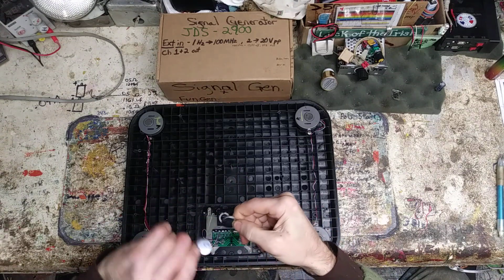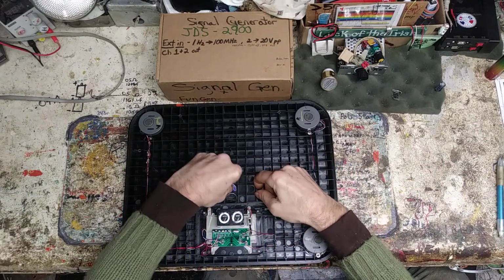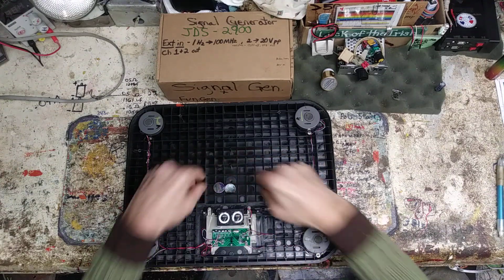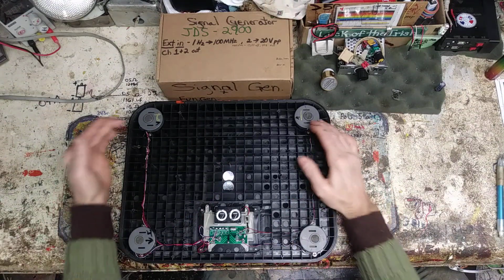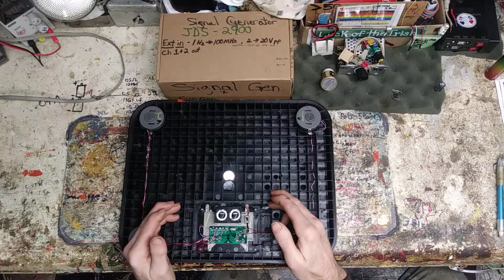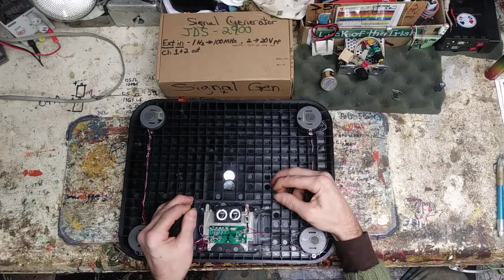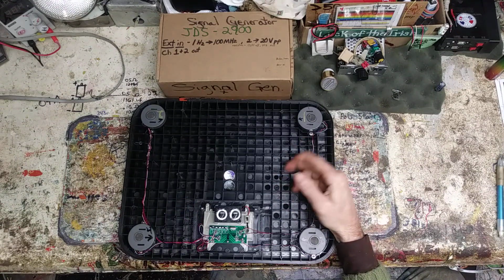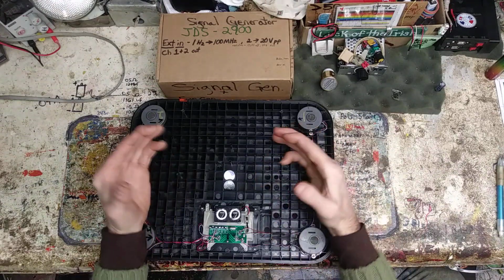I already changed them out. But this one's at 2.9. So these are 2 new batteries. This one's 3.0, and this one is 2.9. So we're going to put them in and see if we get any readings, but I already know we're not. So I know that it's either my load cells, which I'm almost doubting. I've been checking it with the multimeter, and I just got really small voltages fluctuating around zero. So it definitely tells me there's something wrong. Probably something wrong with the CPU blob, we'll call it, which is just the IC blob.